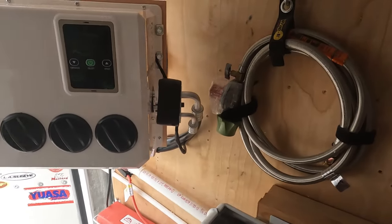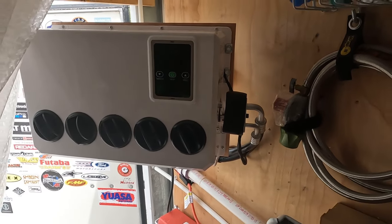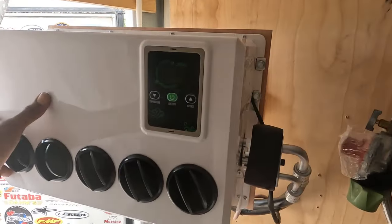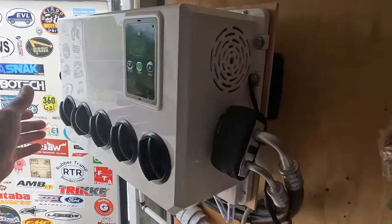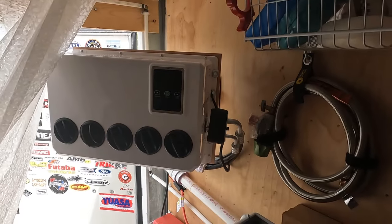Well, through the magic of editing, I got the inside air handler unit mounted. I got the hoses connected at the expansion valve, which is the way it's designed. And you can see it swings back to the wall. And then when I'm ready to use it, I can swing it back away from the wall and point it towards the living space.